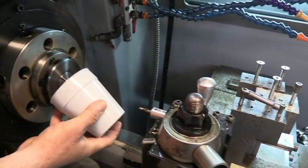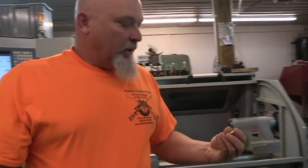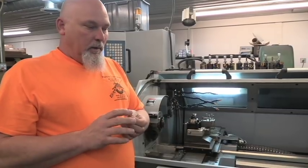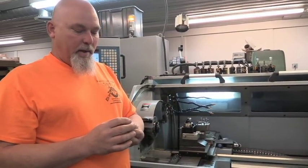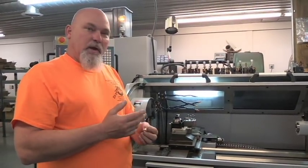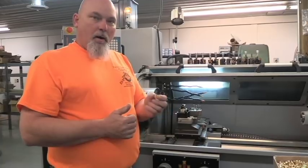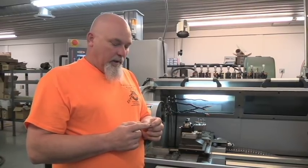You can watch this primer module pop right out — I built a spring-loaded collet to make them a lot easier to get out. We finished up the video on how to make the primer modules. They go through a very strict quality control check. Once in a while one will slip through that didn't meet quality control, but it's very rare. The headspace on these is consistent from batch to batch, and I check each one with a micrometer stand to make sure they're correct. That's pretty much it on the primer module making video with the CNC lathe. Subscribe to the YouTube channel, give me a thumbs up, and until next time, we'll see you later.